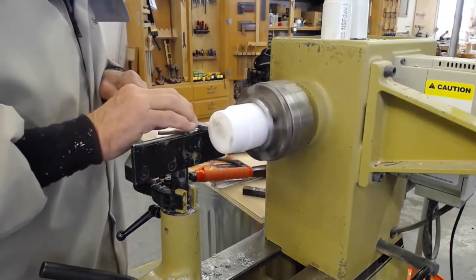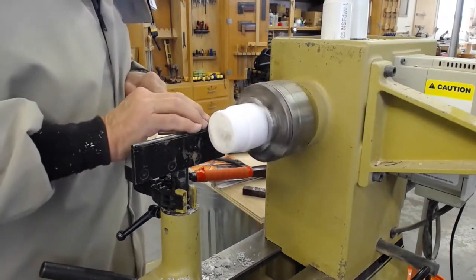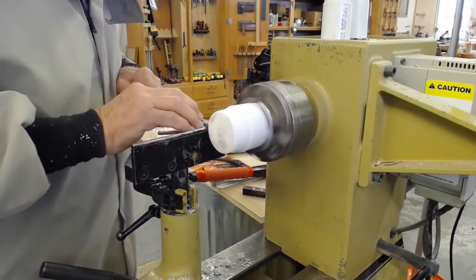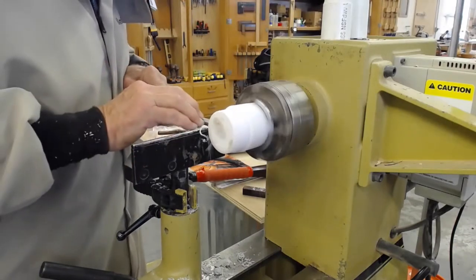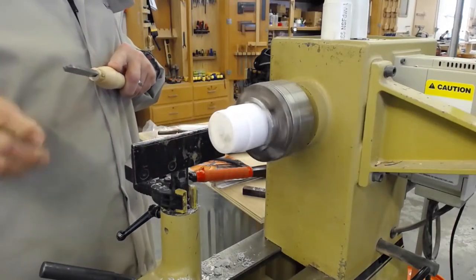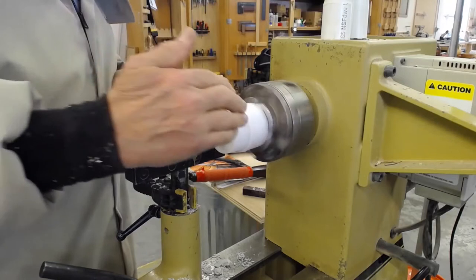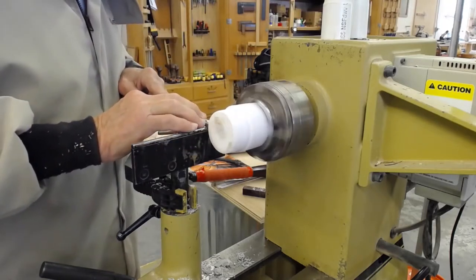Are you trying to get the taper out of that? I am, yeah, and you can do that just by, with the scraper, pressing in a little bit at the end. You can get the taper out, or you can leave it in. It makes it harder to fit the pieces together. It wouldn't act as a starter thread? You mean that little taper would be easier? Well, it's tapered from here to there. That's just a little too far, because then it gets tied up. I mean, ideally, you'd like to keep them parallel. Yeah. But then you have to go over it.